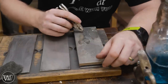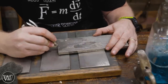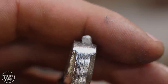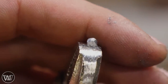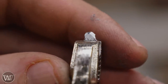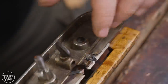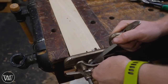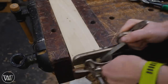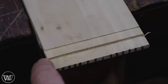If you buy old stock or a replacement, this is where they come — unsharpened. I like to use the edge of the plate, let the vise grips hang over the end. It gives me a little bit more control and I can rock it back and forth. You can see on the backside I've got a slight bevel shaped. So now we can actually sharpen it — that's the side with the screw head, and that's the beveled side that'll actually do the cutting. Then we can very, very carefully install it and take it for a test drive. Always start on the backstroke, pull it back, so you get a nice cut line there and then you can go forward. I for one would be happy with that. You can see the spur is a little bit dull and it's leaving a little bit in the corner, but that's not a huge problem as that will be filled.